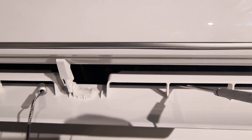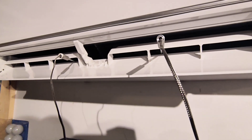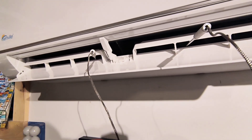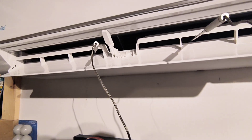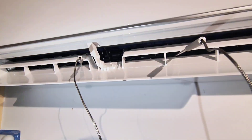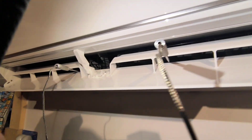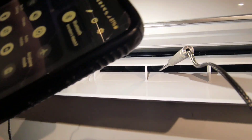This is a meat thermometer, so I was able to get the probes wedged pretty good inside of there. Be careful not to stick it in too far because there's a rotating fan up there, but you also don't want to take the temperature a foot away. You want to get the actual air temp coming out of the heat exchanger.